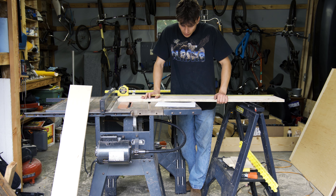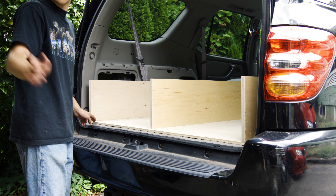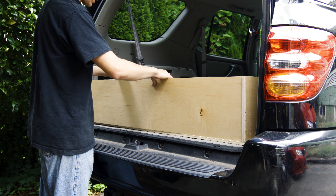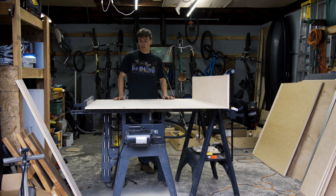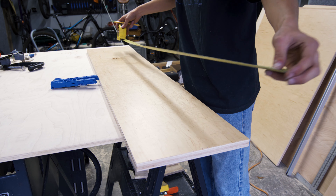Here's where we're at: we have the base cut, and we have four pieces that are three quarters inch thick, 10 and a half inches tall, and 50 inches long. The two on the outside at 50 inches are good to go, but the middle piece I'm going to trim by three quarters of an inch. The back piece is going to get trimmed to fit in between the sides — looks like we're cutting it to 46 and a half inches. I've set up how it's going to look once cut, with about three quarters of an inch at the end so the back piece can sit in between the two outer pieces.